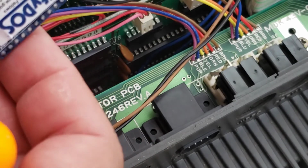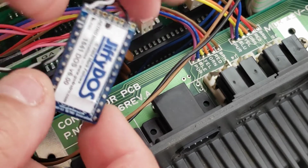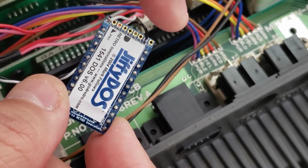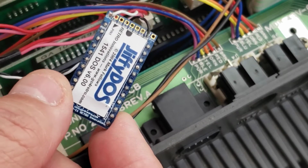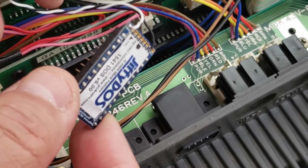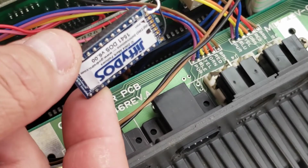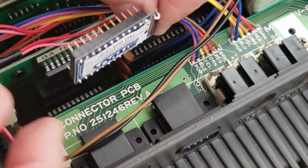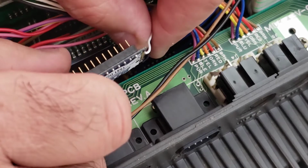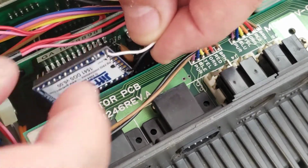We're putting the Ultra reset switch in here, which is going to electronically switch, so we're not going to need the mechanical switch here. And we're going to end up not using the ground wire on this, but I still leave it on there because I like the originality, just in case, you never know. So that's the deal. Make sure that when it goes in, it's just straight over the sockets. You don't want to bend these pins or not get all the pins in. That'll kind of suck.